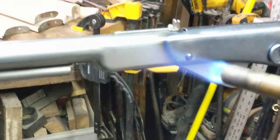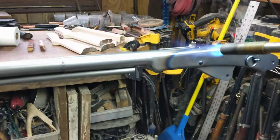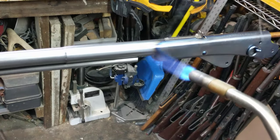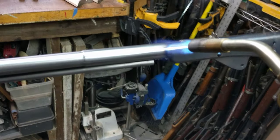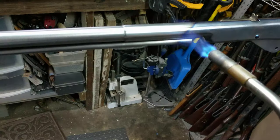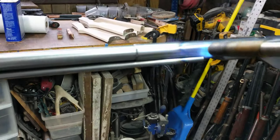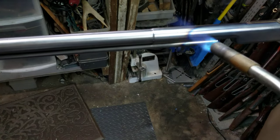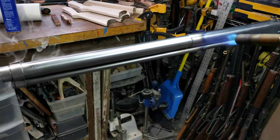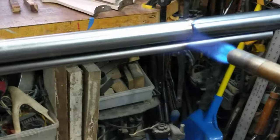It's always interesting to watch as it creeps up the steel. The temperature of the tip is where it's hottest, so that's basically where you want to focus your energy. It's starting to smoke pretty good now, and as you can see it's basically creeping up the steel line. You don't ever want to get this stuff to the point where you're seeing a cherry red — if you've got it that hot, it's way too hot. You want it at about 550 degrees or so to get the blue color you're looking for. Since you're working on a big piece of steel and you're not doing it all at one time, you're doing piecework. You just watch your flow and roll it down. It's not the hardest thing in the world to do, but it does take some time.